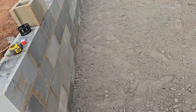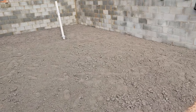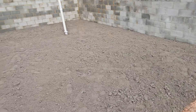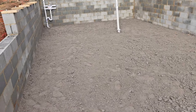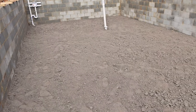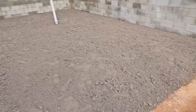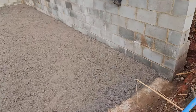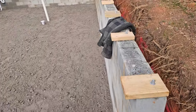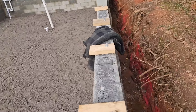Otherwise, we've got that in. We've used our nice little laser level to get it all good and level across here, and it is ready for the next step — which is putting down plastic, then mesh, and then we will be pouring concrete in here next Wednesday as long as it's not raining. Hopefully it's not, but the weather is actually saying that it may rain, so hopefully that's either late afternoon or changes to not at all.